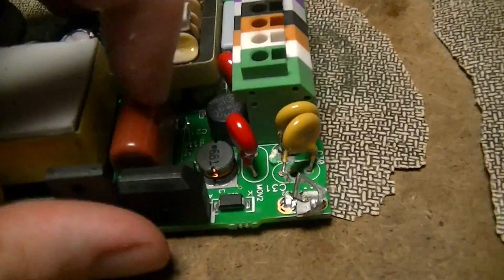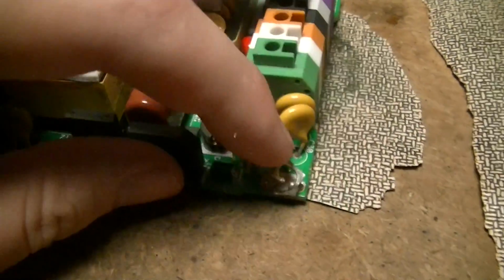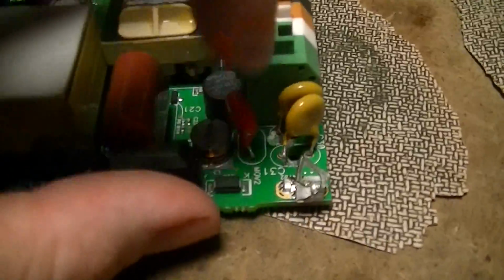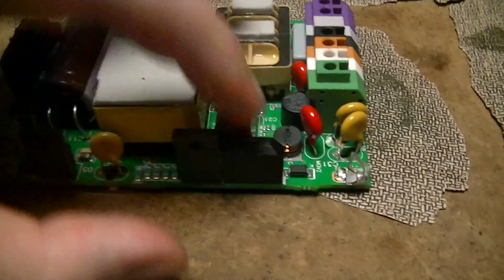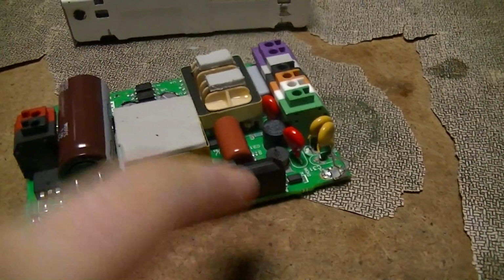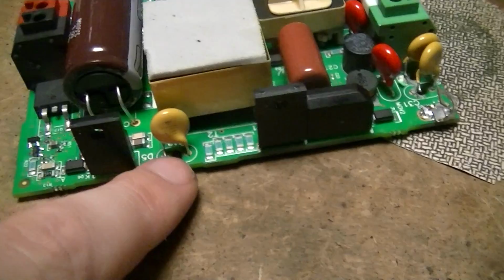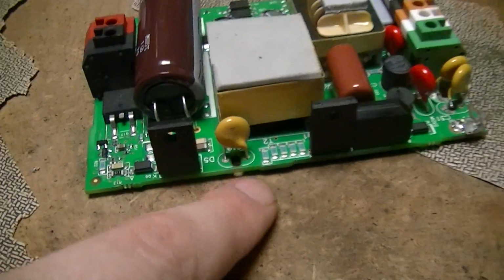A couple of, I think those are, no, those red things are varistors. A couple of caps which I kind of grunched because I had to drill out a rivet, but I think those are just suppression. It didn't show any inner traces in the board, so I'm just going to resolder those before I use it. A couple of power devices, the switching FETs, bridge rectifier, another cap for ESD suppression, that cap which looks to be crossing an isolation barrier. So that's just the EMI suppression thing.